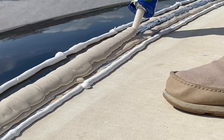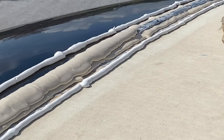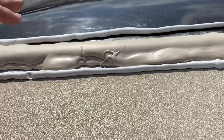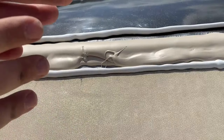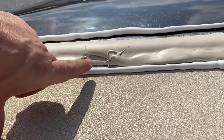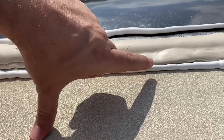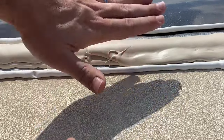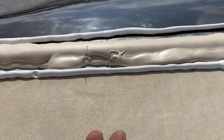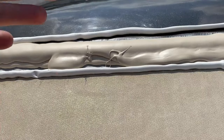You can see he's applying it just to the top rail there, and then the weight of it — that's where the self-leveling comes in — it slides down the sides. Now, I know some people are going to say you don't have to do this caulk barrier, and that's fine. I just take it as an extra step. You can see in some locations the lap seal didn't go all the way down to the barrier, which is fine. But over here it did, and if this barrier wasn't here it would have just continued to run down into the roof further than it needed to. So yes, it's an added step — do you need to do it? No. But I always do and I would recommend it.